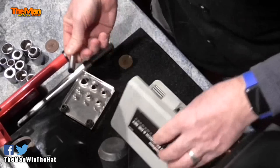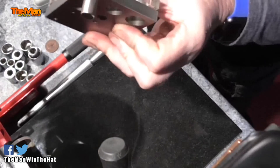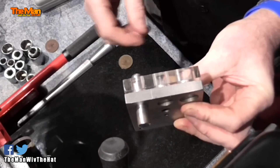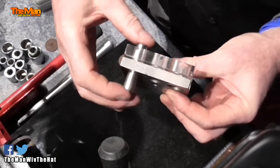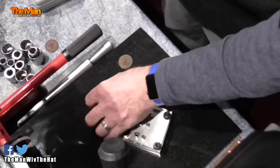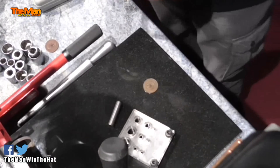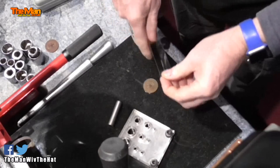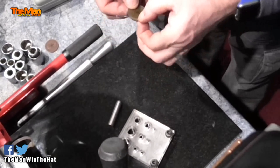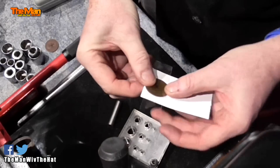I'll go with a half-inch hole. The half-inch punch goes all the way through when you strike it. I'm not going to be hitting with a hammer — I'm going to use a press, which is essentially a car jack capable of carrying six tons. To prevent the ink dot from rubbing off, I'll put tape over it.